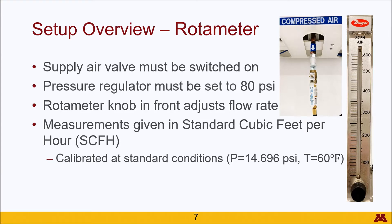You'll notice I mentioned the word "standard" rather than just saying cubic feet per hour. The reason is that when the rotometer was created, it was calibrated to the conditions of 14.696 psi at a temperature of 60 degrees Fahrenheit. So as the experimental conditions vary from those standard conditions, the flow rate quoted by the rotometer gets adjusted. For the sake of this experiment, we won't really consider any corrections needed, but know that if you enter particularly hot temperatures or really compressible flow regions, you will need to make corrections for this.